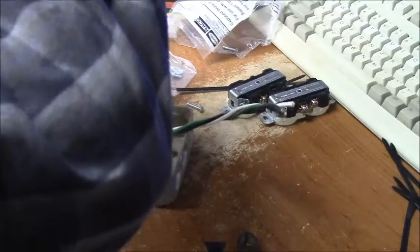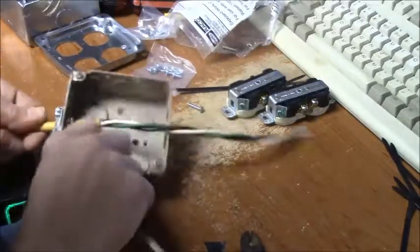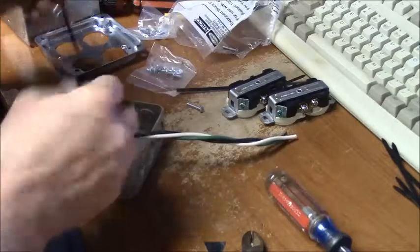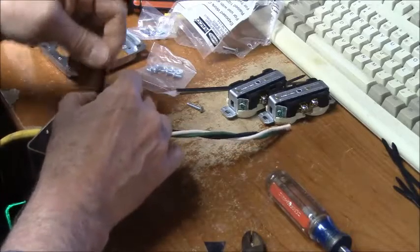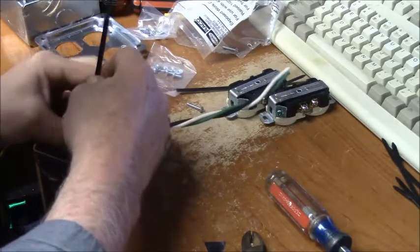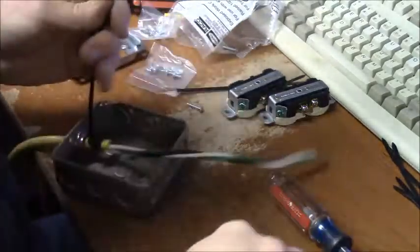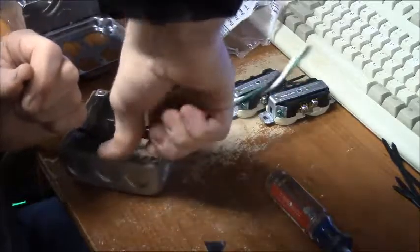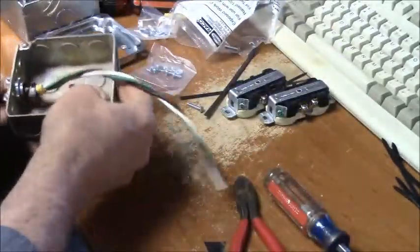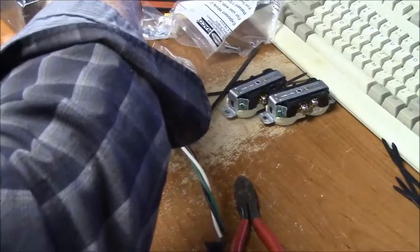Let me loosen up that wire for just a minute here, so I can rotate that around and get the head of the other tie wrap on the other end here. Like so. Just kind of make this like a big plug, so she won't pull free. Push on that while you pull on the end. I'm not cutting it yet. All right. Down there. See, that'll never pull out. Strain relief.